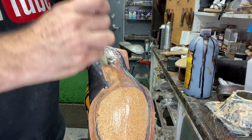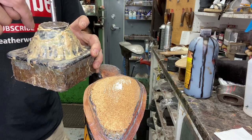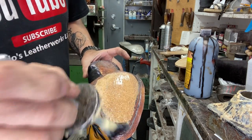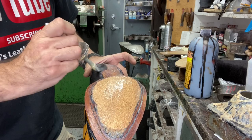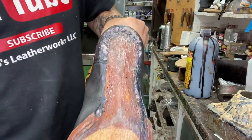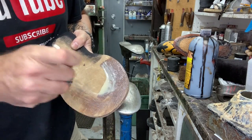And besides, when you're removing the glue from the pot and it gets on the edges, and you put your brush down, now all of a sudden this seals it in place and it's hard to pull up. Then you've got to hold the pot and pull the brush out, which is not good. I do that sometimes at night, for example. I'll put a little glue around the edges, so when you put the brush in it gets a tight seal, so not much air gets in for the glue to dry. But on a normal work day, I try not to keep anything on that edge of the glue pot, because I don't want to fight with it trying to remove the brush.